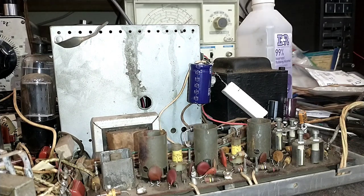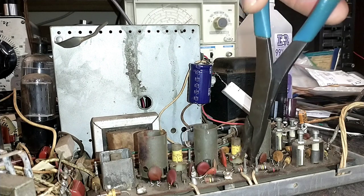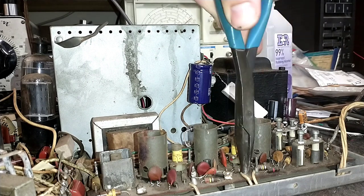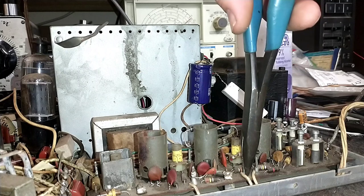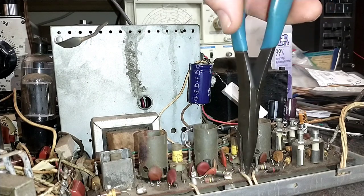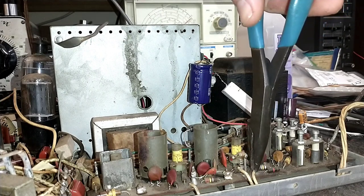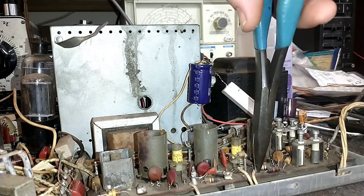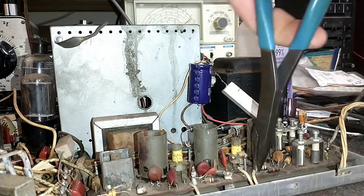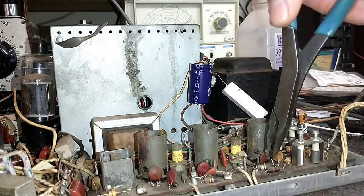Let's focus on getting the board out. What I'm going to do is start undoing wire wraps, which is no fun but you have to do it. I just very lightly squeeze down enough to catch the wrap and unwrap them little by little. We're going to solder these back down, so I'm not worried about the wrap part. I hate wire wraps — I'd rather it just be plug-ins or solders.